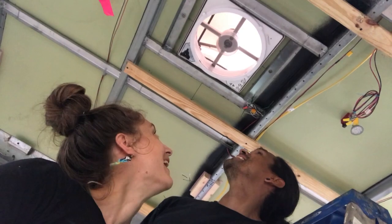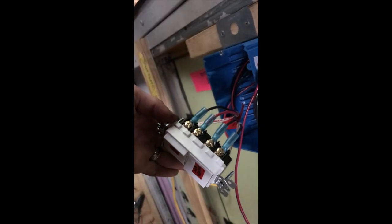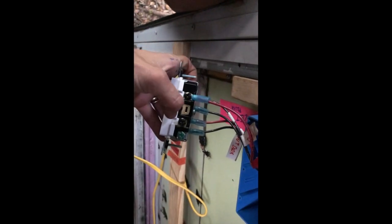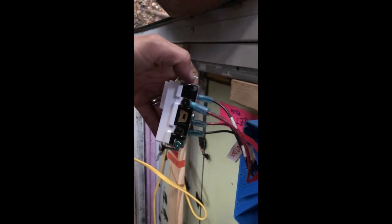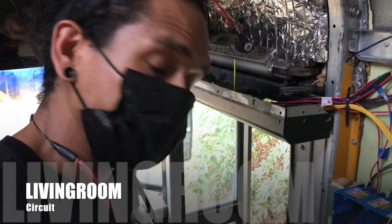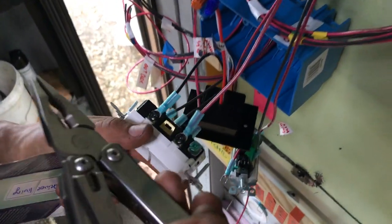It lights up! Here are our two three-way switches. Those are the travelers, and from my fuse box the hot power — if we don't break this part — is gonna feed both switches. You need to break this fin in order to separate the two switches, because they are two separate circuits.